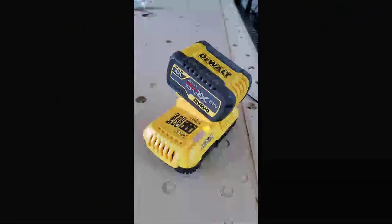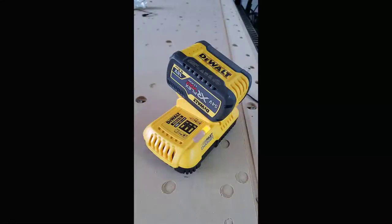And here's the picture of the battery and the charger. Because I used it and it just went through in that one run, it got rid of its charge very quickly in comparison to what it would with, say, a plane or a drop saw. The batteries get hot, and they have the same kind of thing as Festool do, a fan-forced charger that blows cool air around the cells and cools it down. When the battery's got to the right temperature, that yellow light goes off and it starts charging. It takes about an hour and 20 minutes to charge that one battery, but you get a lot of life out of it. Unbelievable.